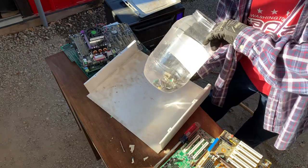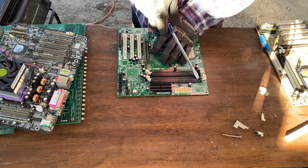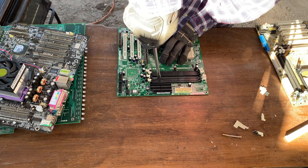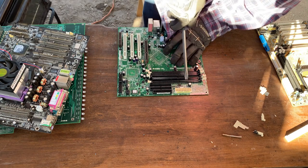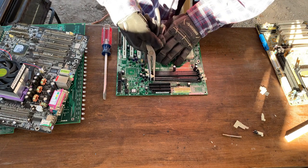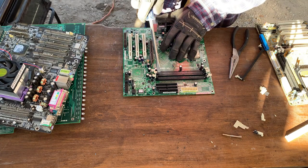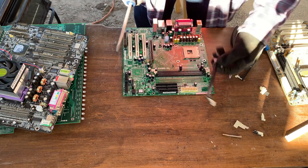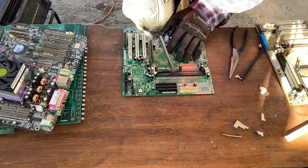Okay, so there's all of our pins from one motherboard. I put a second board in — we're going to let that run while I show you this. I wanted to show you how easy some of these RAM slots really should be. You just put the screwdriver down and separate them a little bit. By separating just the slightest amount here, you're actually going to be able to just peel it right up. This one is turning out to be practically a perfect example — it's that easy. I don't know why that other board was such a pain, but it was. When they're so close together like that, it practically makes the second pair practically done too. It makes me crazy that that first example was so terrible.